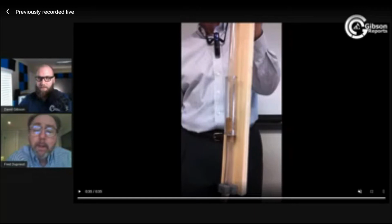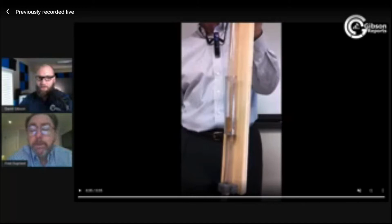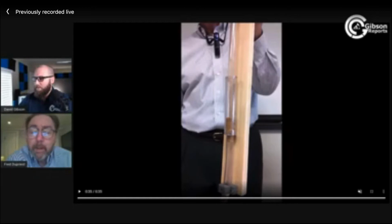We don't necessarily need a different fluid, because when we do need a different fluid, we're pretty good about doing that. We're really bad about running the mud weight required to drill gauge hole, because we don't really understand all the value. If we're not getting stuck and have high NPT, if we're just slow drilling in an extended reach well because we see pack offs when they go faster, we're not thinking about that as an instability problem, and tweaking the mud weight, you know, 0.3 pounds per gallon might make it go away. We think of it as, well, I just can't drill faster than that. That's as fast as I can clean the hole.